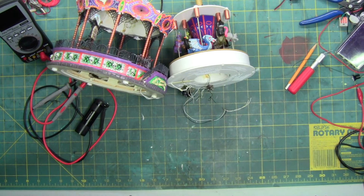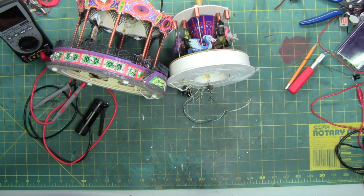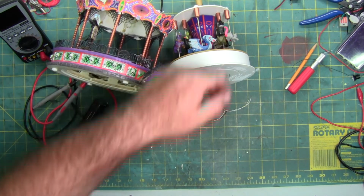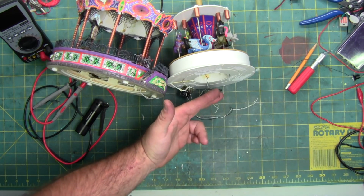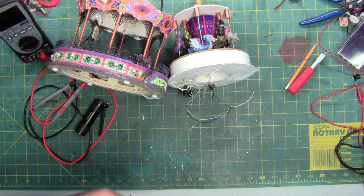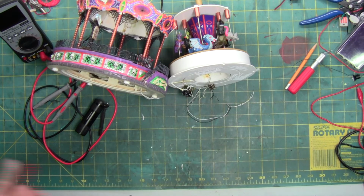From what I can tell on this unit, as well as a Department 56 that had a very similar issue because it uses the same exact chip, the chip probably shorted out, or something shorted it out. One of the wires may have broken in advance, which then backfed down the center to this. This got really hot, which is soldered or glued right next to this board. Possibly the heat from that caused a failure on one of the speaker wires, or that's just coincidental, which then shorted out the speaker, shorting out that resistor, and causing it to smoke.